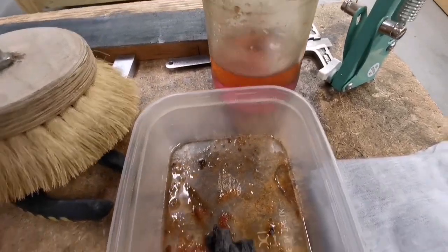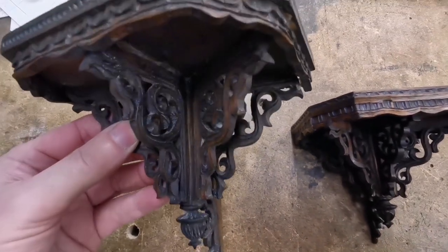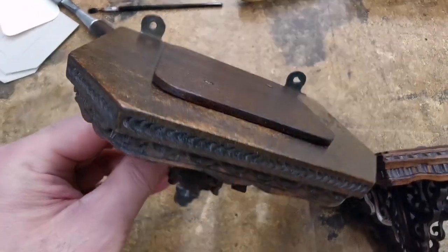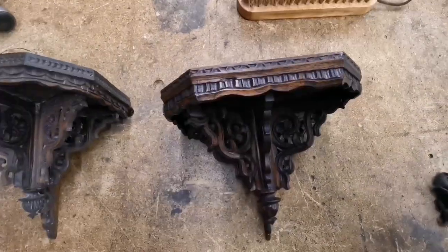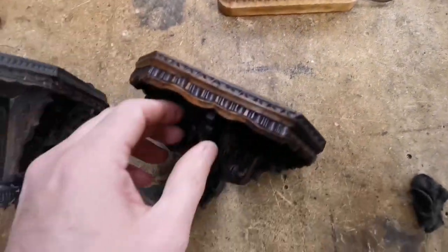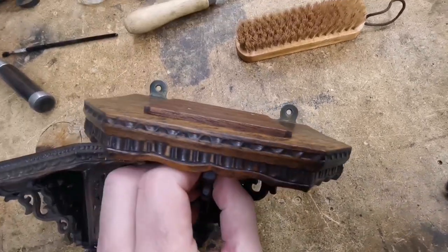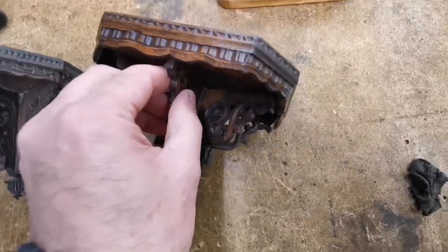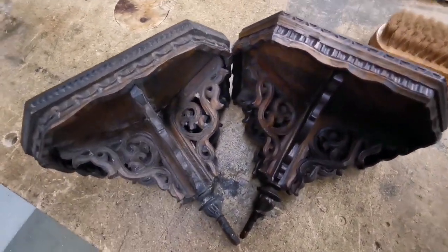This is the reviver that I use. It's settled down now and gone a bit. But this is the difference between the two. So if we look inside here, we can see traces of wax, which I've had to warm up and get off because look at it. And this is one that I've now finished. Used a reviver, and then I've gently gone over it with a brush that I use for polishing up. Buffing up wax surfaces. I know the colour's not 100%, but actually you will only see a little bit of it. But it's that sheen I'm after, which is, if you see the two side by side, you can see the difference. They really are quite different.